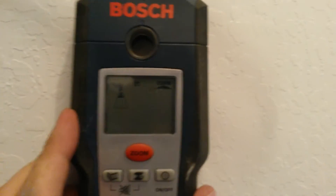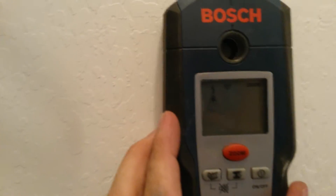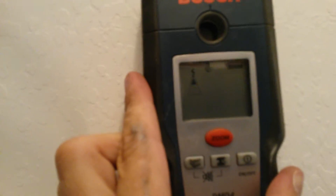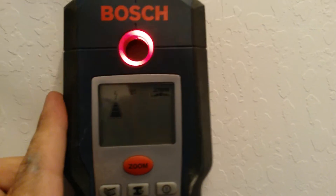One other feature that's kind of cool is the live wire detection. Anytime you get anywhere near a live electrical wire, you see that bar — that graph going up. You can see there's an electrical wire running down this stud here, so it's going to flash red. That basically tells you there's an electrical wire there and to be careful when drilling or cutting.